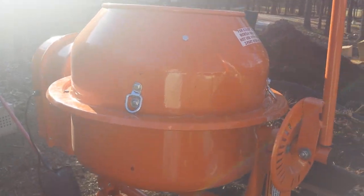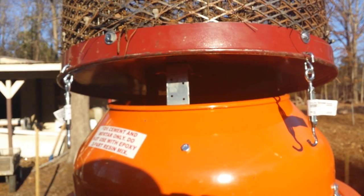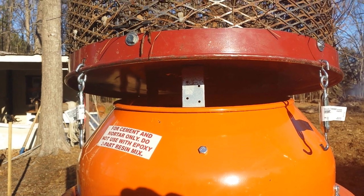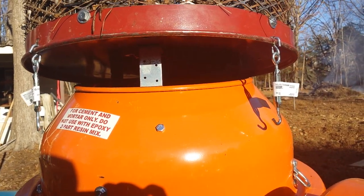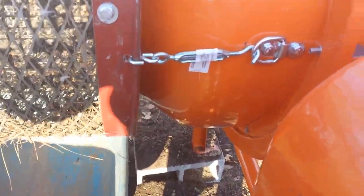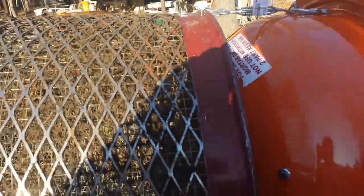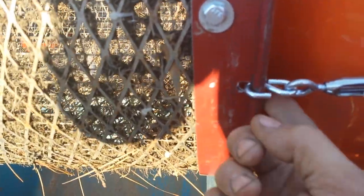I'm going to put this barrel up on top of it and show you real quick, then give it a little test run. You can see those three little brackets right there — they basically fit perfectly inside that hole. I'm going to drop it down into place and put the turnbuckles on it. These turnbuckles — looks like they are 7/32nds by six and a quarter inch. I used a little S-hook to connect it here, just drilled a hole through the drum and connected it there, and then on the other end it just screws in and tightens up nice. It holds good and runs well.